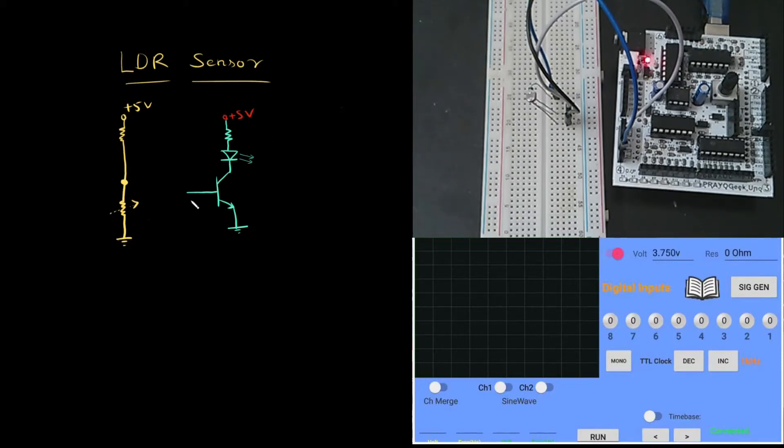Can you recall the minimum voltage required to turn on the transistor? If you said 0.7 volts, you are right. We need at least 0.7 volts to turn on the transistor, and the voltage must go below 0.7 volts to turn it off. So if we connect this junction to the transistor base to automatically control an LED using the LDR sensor, the voltage at this point must swing below and above 0.7 volts according to the intensity of light.